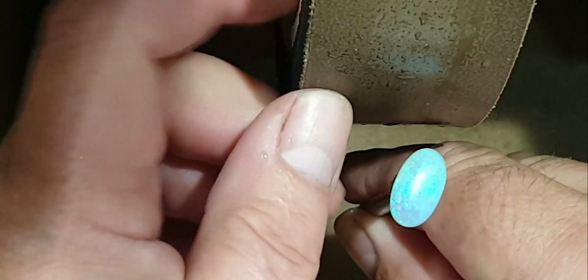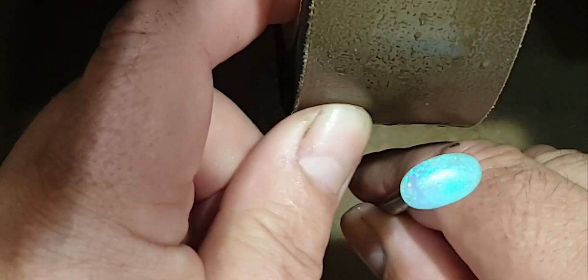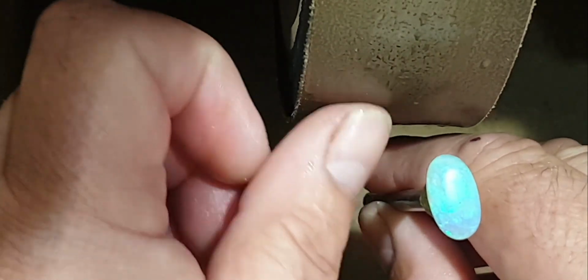All right, this is on the 600 flexi wheel. I thought I'll just quickly show you this stage. We do a final shaping on this wheel. It's actually quite flexible, as you can see, so it still will take a little bit of material off. This one's quite worn now, so I actually like this. It doesn't take much off at all. And we'll do a final shaping, and we'll also do a base. We're getting it nice and smooth, and then we'll go to the next wheels and polish.